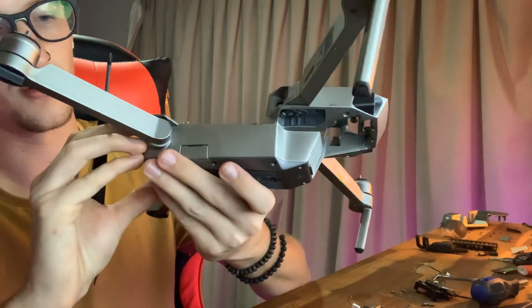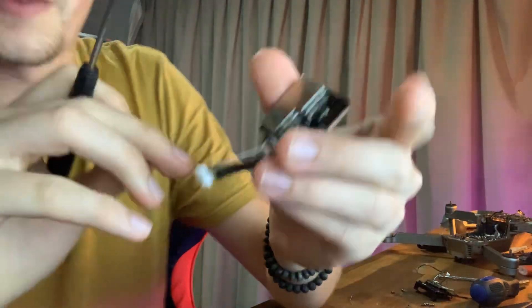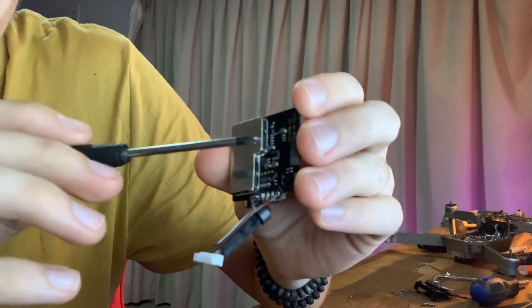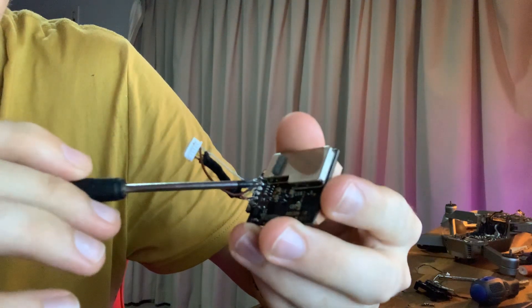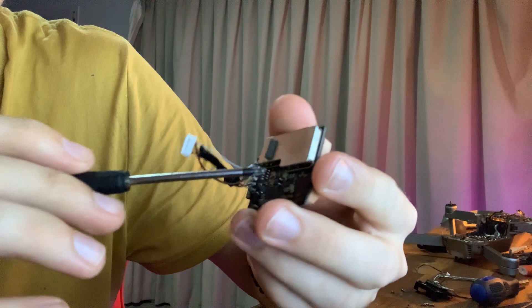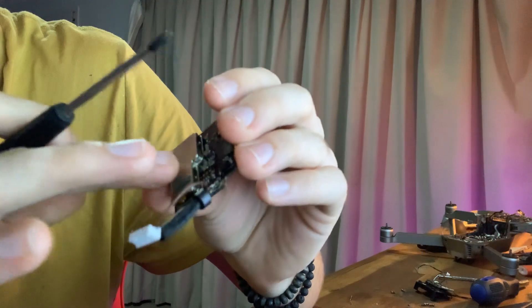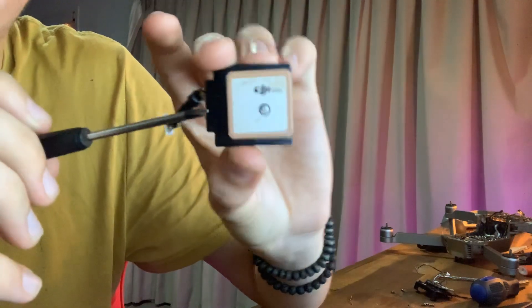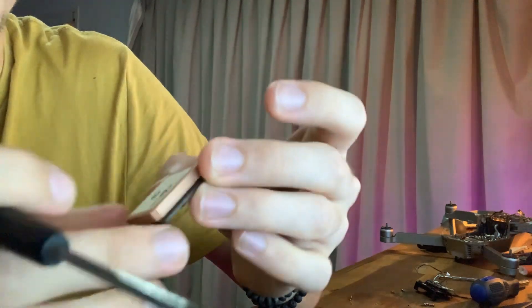So I had a bit of a further look. All the actual connection points on the unit looked fine. I had a look at the actual GPS unit itself and had a look at some of the resistors. I got a multimeter and tested the resistance on each little resistor — they all seemed to be fine. There were no burn marks I could see on the unit itself. When you turn it over, there's a little GPS ceramic plate on the back — no cracks, no burns, and it's not loose.